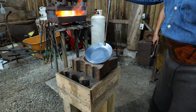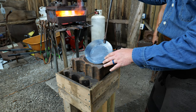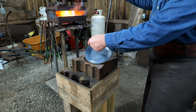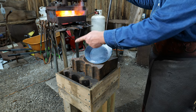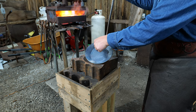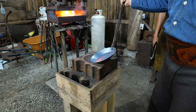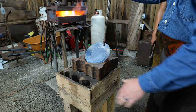Thomas has got this done now. As you can see, the line around the bottom has really crisped up nicely. The way you do that is by doing smaller and smaller steps with each set hammer blow — on the first go-around you're laying the blows almost right next to one another, on the second go-around you're doing them half on top of each other, and on the third go-around you're moving it maybe a quarter of an inch at a time. That's what really helps define that bottom and crisps it up. Now we'll move on to making sure the rim pops up nicely, is even, and the bottom is flat.